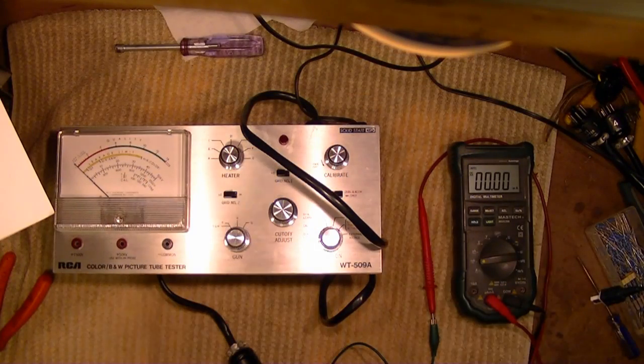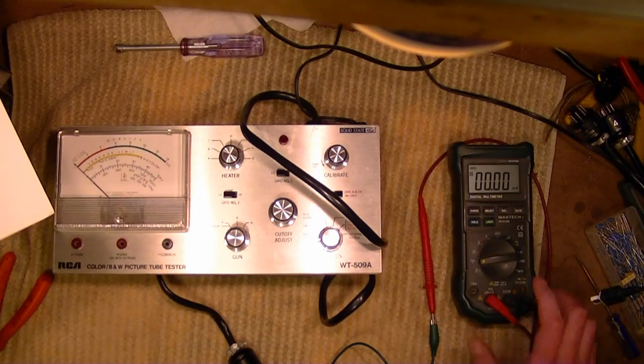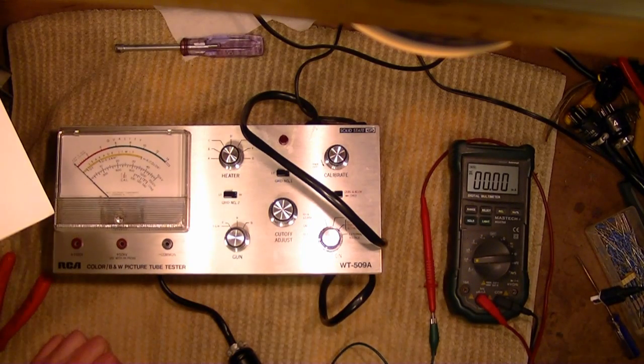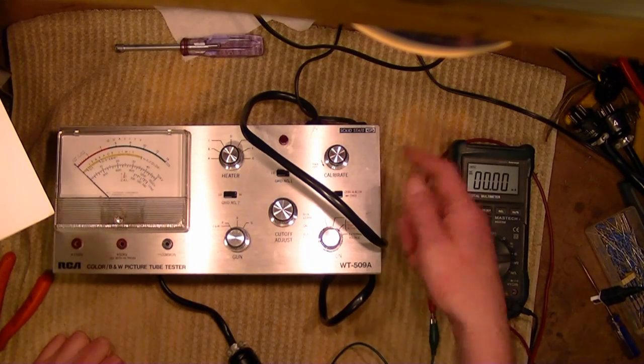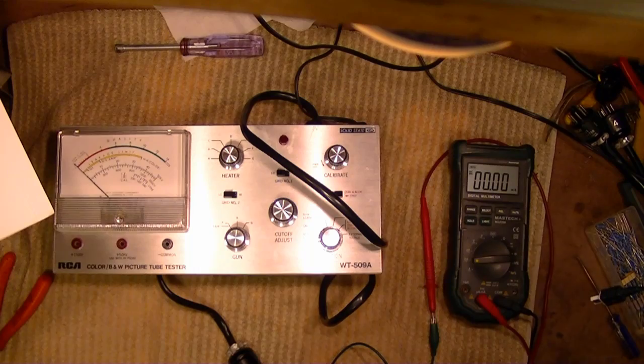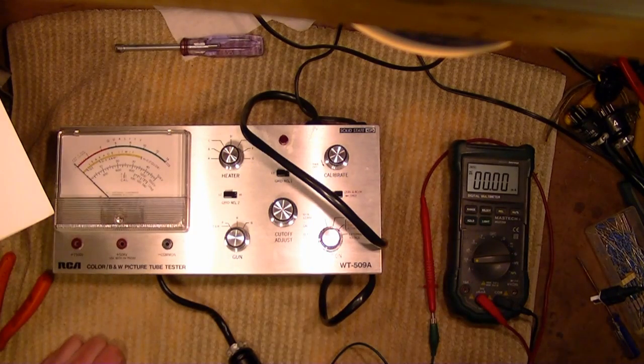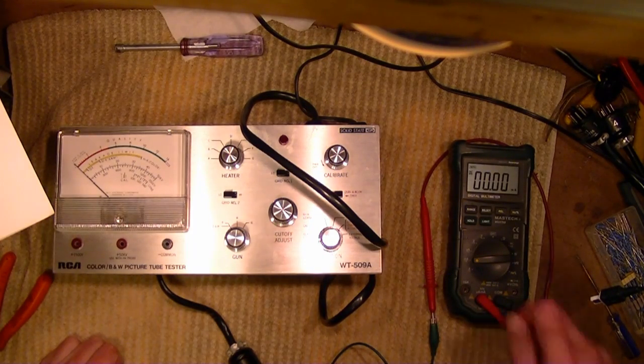Alright, for this last test, I need to have a milliamp meter and my Fluke 27. I think the fuse is out on the milliamp range, so I had to switch over to my old Mastech meter. So this is going to check the restore current, or what they call activation, I guess. So we want to limit that to 1 milliamp. So let's see how that goes.